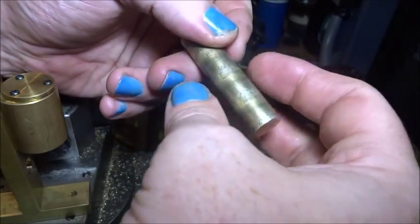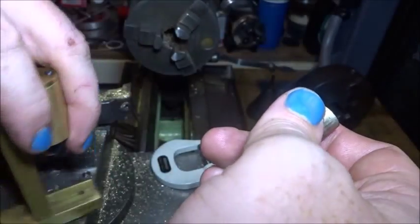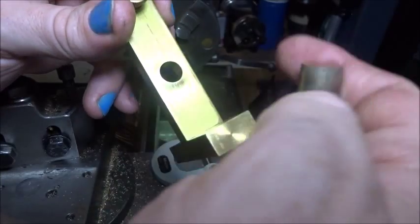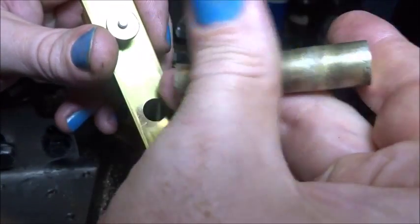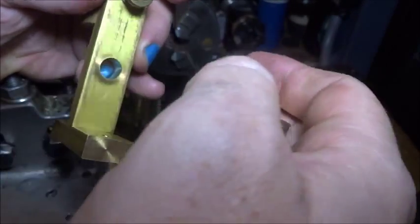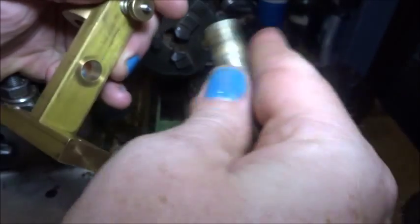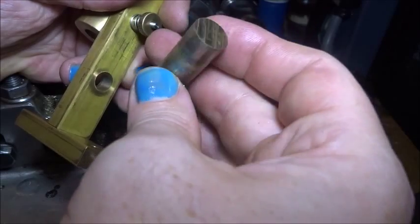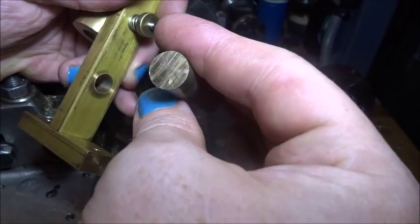When I looked at it there were lots of ways I could have done this. I could have got a bigger bit and put three holes in it with a flange, the same as the drawing says. I could have made a steel shell and made a push-in bearing, or put a little lip on it with a brass cover with three holes to retain it. But Loctite is as good as anything — it looks nice and neat and it's going to be nice and square.